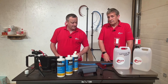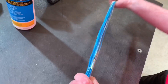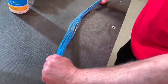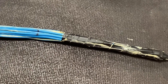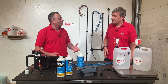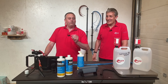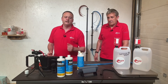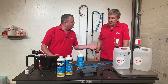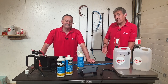We squirt some lubricant into hand — this is a wax-based lubricant, easy to wash off your hands but doesn't wash off the cable easily. It's suitable for PVC and cross-linked polyethylene and most cable types, so it won't damage or eat into the cables. That's the problem when electricians use their own formula — washing-up liquid, vegetable oil, shower gel — and on steel conduit systems, cutting compound, which is probably the worst thing you can put on cables. Lubrication is also useful when adding an additional circuit to a conduit that's already packed with cables.